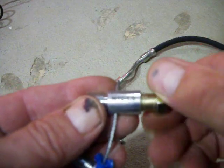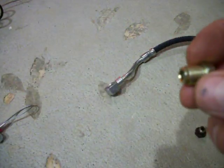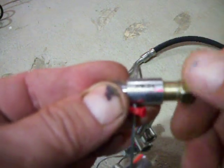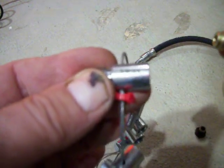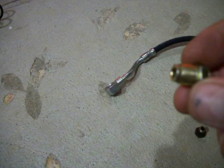This is the stock fitting right here. I went out and bought some metric fittings thinking the line was metric. You'll see my metric M10 1.0 fits that thread gauge fine, but when I attempt to put the metric one into the English fitting it doesn't go. So the English 3/8-24 goes into the M10 1.0 gauge, but the M10 1.0 does not go in the 3/8-24 inch — that will get you rather confused, as it has me for the last few days.